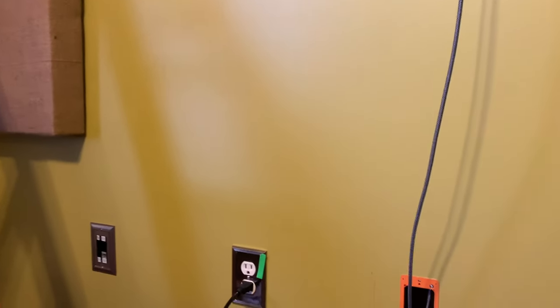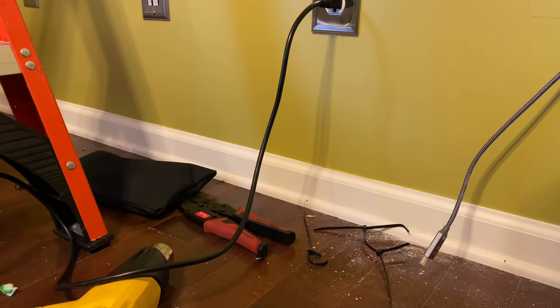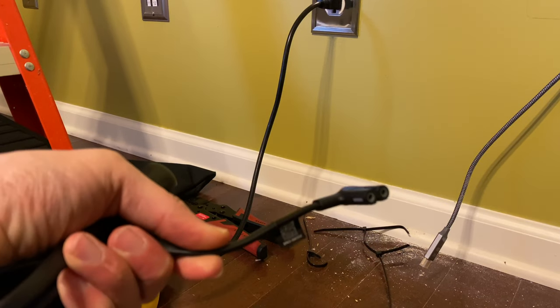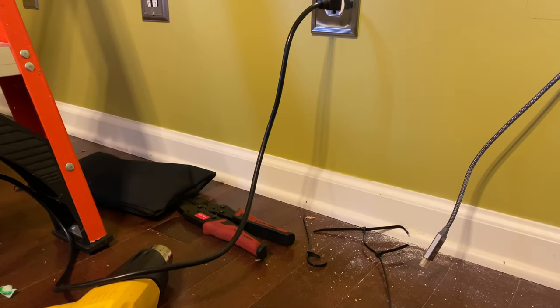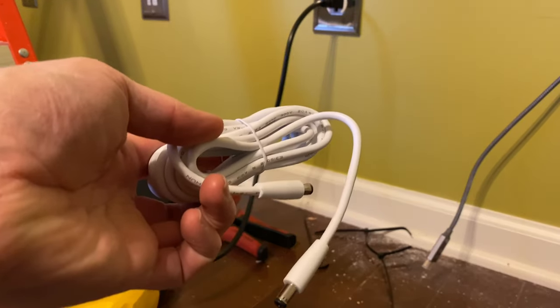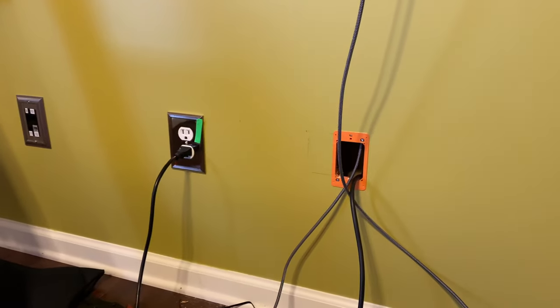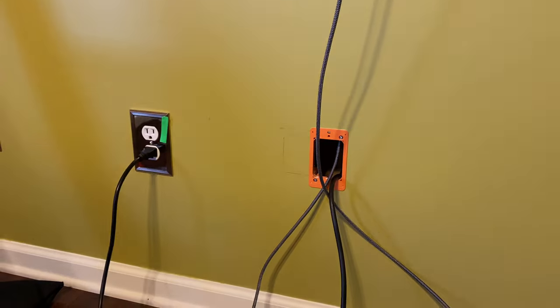And then as far as cabling goes, I need to actually splice. I have a roll of 14-3 SJO cable that I'm going to use to splice. The Samsung outlet on the TV is just a little Infinity thing, so unfortunately I can't use the IEC that's in the wall. I also have my Philips Hue cable to run, and I'm going to run hardwired Ethernet up to the monitor because I figured if we're this far, we might as well do it. I'm going to use the IEC cable that's in the wall to pull it. And I have a little brush panel that's going to go in this new workbox here. So we're going to splice the power cables now.